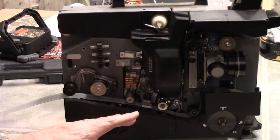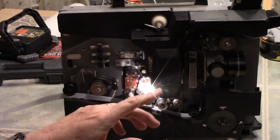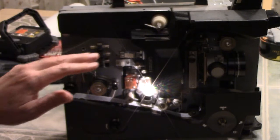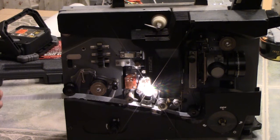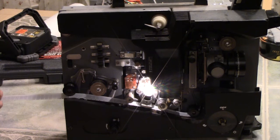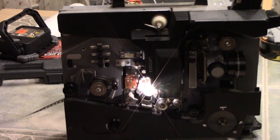We still have a roller problem, so running film is a bad idea. But the cool thing about these projectors is the sound will work without film. You can sort of hear a little hiss — a low little hiss noise — which is a good sign, because over time the amplifiers gained a little background noise. So we're going to pull some film through it; it won't be focused, so we won't get great sound, but we should get some kind of sound. And that's perfect — we know we've got sound and it's working. By replacing the board, that got us working.